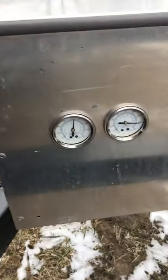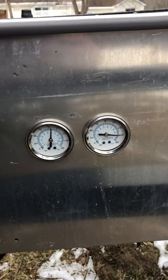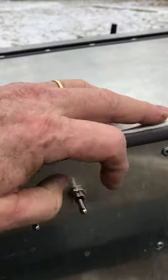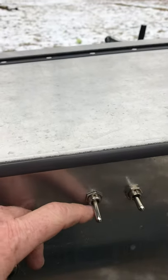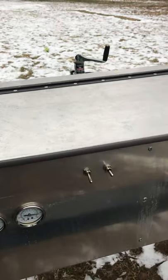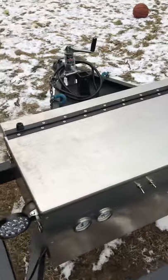So you've got a couple of gauges — one is regulated on the left, the other one on the right shows what's in the tank. Inside I've got a couple of switches: this one's a three-way — down lowers the bags, up raises the bags, middle is off. This other one is just off and on, and I have this switch wired up to these fork lights. When it's down, it's wired so the backup lights on the truck will activate these.